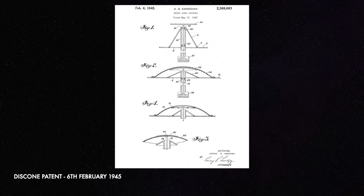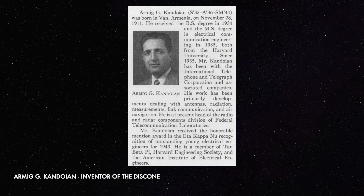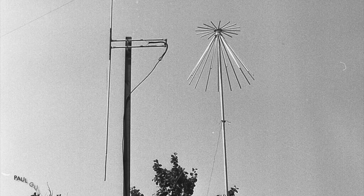They're a type of wideband antenna designed to operate over an extremely wide range of frequencies. You'll often see frequency ranges advertised at 0.5 to 3,000 MHz, though no antenna can be truly effective over all of this portion of spectrum. They became extremely popular during the 1990s when people realised you could listen to all manner of things — from CB radio on 27 MHz right up to analogue mobile phone calls in the 900 MHz range and everything in between.